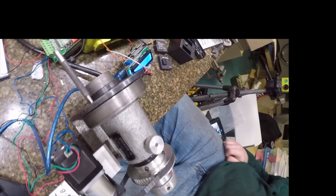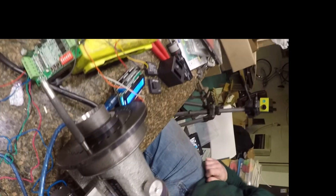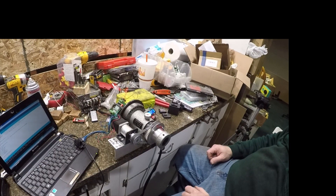On the backside here you can see there's matching index marks. In this case I've got it lined right up with zero. It's a tapered punch — a straight punch with a taper on the end — so it lines up really nicely when I get it in the right position. And I'm set on zero. Any one of these positions could be zero depending on what you're doing.